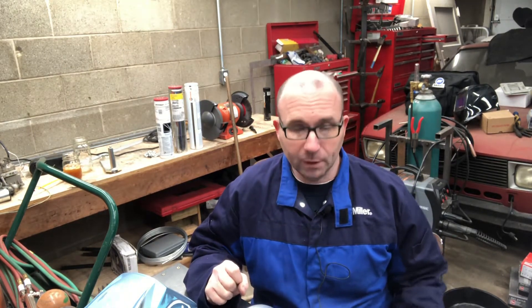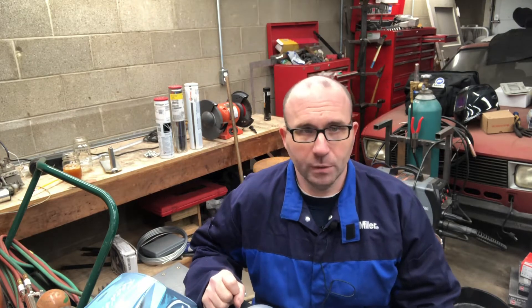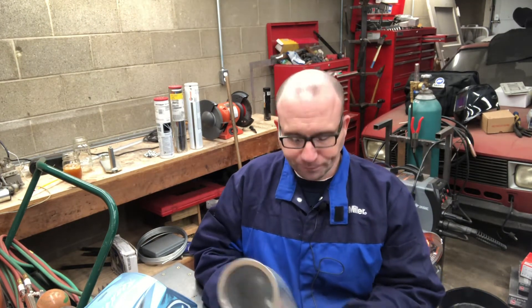From the surface, we're talking mostly about oils left over from machining processes that get pushed into little pores. I use a three-step cleaning process. I often work with older scrap material because it's what's available and aluminum is expensive. Any piece of aluminum, fresh from the mill or manufacturer, needs cleaning before it's welded. I start with denatured alcohol and wipe it down first before any abrasion.